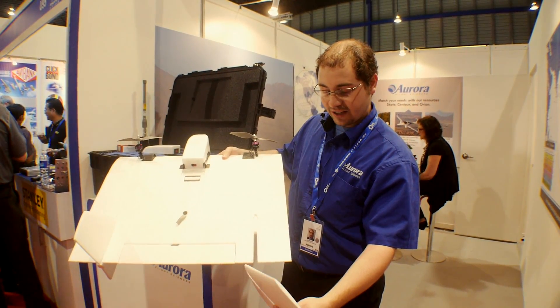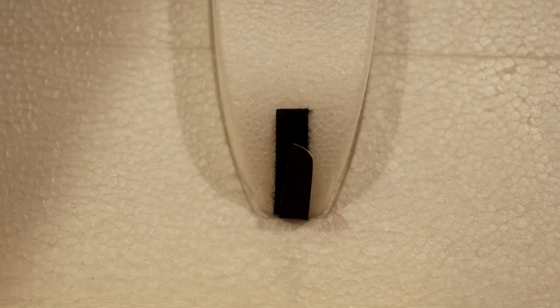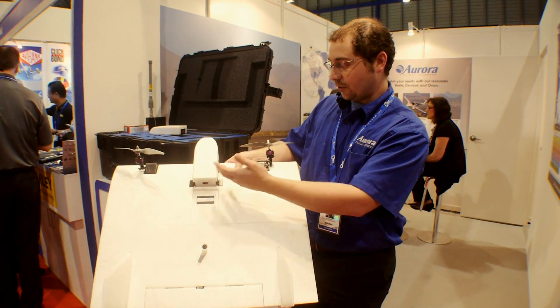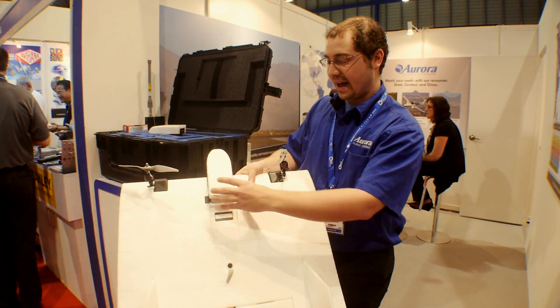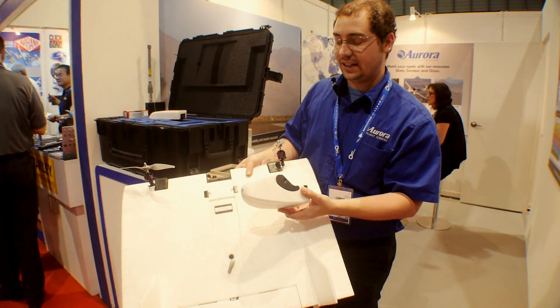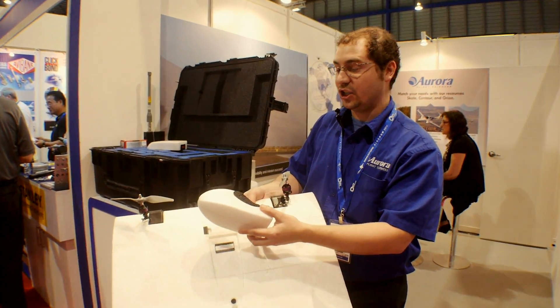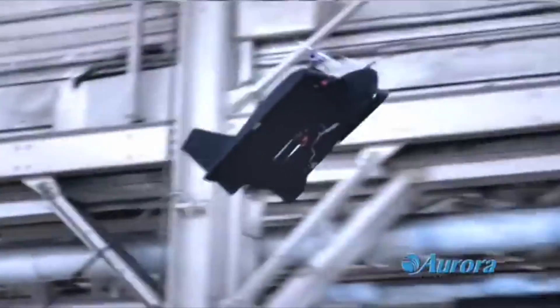You'll see here that many of the components are modular. It's also manufactured out of a very lightweight yet robust styrofoam material called expanded polypropylene. All of the components are modular with quick disconnects or magnetic mounts. This not only makes assembly easy, but it also means any impact damage or energy is dispersed through separation of components, which can then easily be reapplied.